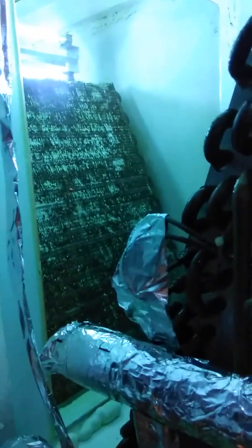If you take a look at this coil, in my opinion, I don't think that coil is... I mean, take a look at it. I've done all I can to clean it. I know there's coil cleaner and all that stuff you can buy, but the coil gets so close to the pan. If I use coil cleaner it's going to overflow the pan, get coil cleaner all over down the side of the furnace and make a mess. And the fins are bent anyway, so I've kind of given up on that coil.